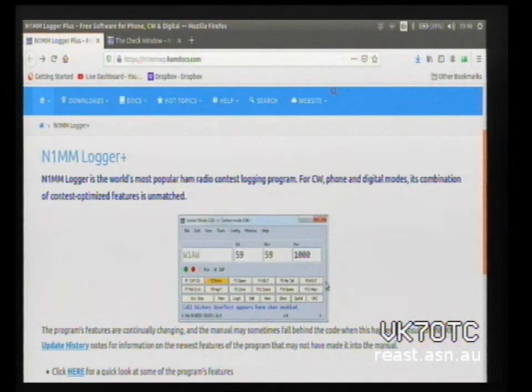So, that voice keying, if you are using two radios, you only need to set that up once, I assume, and assign it to that key in that window. Yep, right. So F1 on mine, for instance, is CQ, and it doesn't matter which window I'm in. The folder structure is N1MM, Lance or VK7ZA, and then CQ.wav. So it's going to play that same WAV file regardless of which rig I'm using.